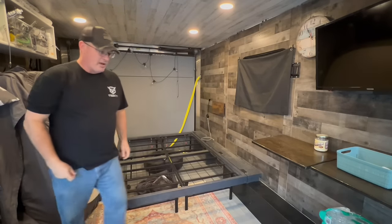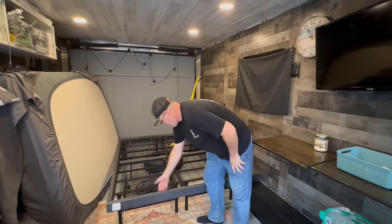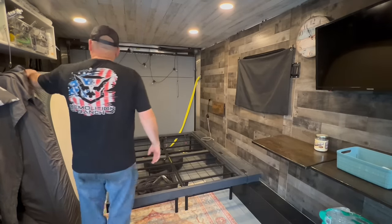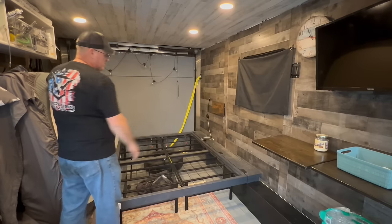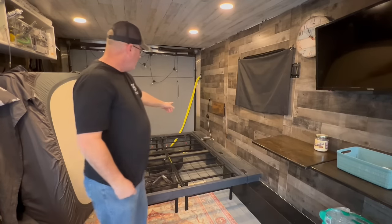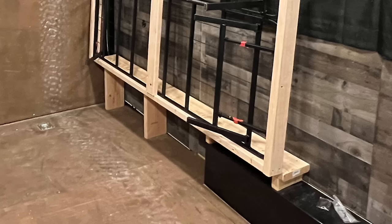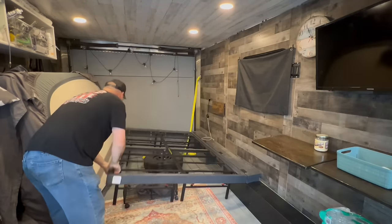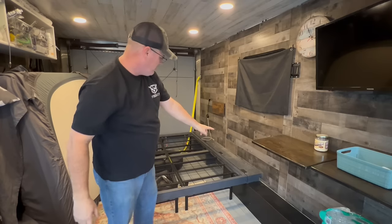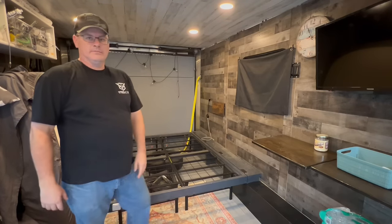The actual bed frame — this is for a twin bed but I have a queen here. I have the Amazon bed frame recessed a little bit inside so there's a lip that holds the mattress in and it doesn't slide off. With a full size it fits perfectly; with a queen size we slide it up over the side slightly. We did a 2x6 along the top with a couple of studs, screwed that into the wall so the frame just easily lifts and goes back down. Four door hinges along from the 2x6 to the 2x4 and it works great. We're really happy with it.